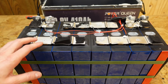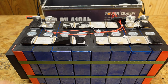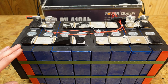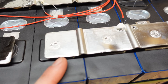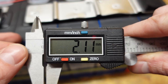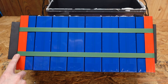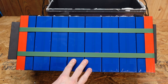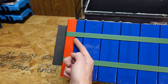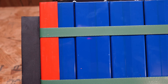These batteries are wired in groups of two, and then those groups of two are wired in series to give us the 12.8 volt nominal. Since these are 206 amp hour cells, the pack has a capacity of 412 amp hours. The battery connections are thick pieces of aluminum, laser welded down to the posts, measuring 2.1 millimeters in thickness. The pack is held together with two plastic packaging straps with good tension, and I like seeing the corner pieces preventing the strap from biting into the cells.